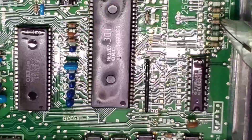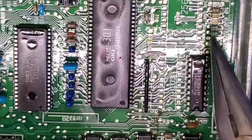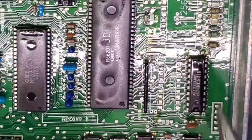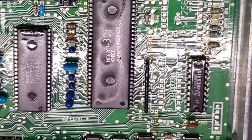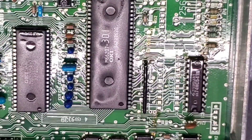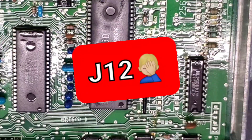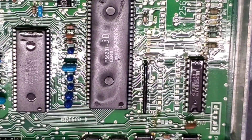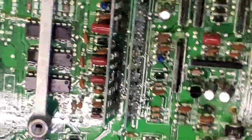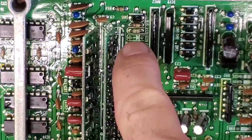We'll remove the RP-17 and RP-18. Most people will tell you to just put a piece of wire between the two connecting points on the RP-18, but I like to use a zero impedance resistor. You can buy them brand new, or you can take them off of the J-17 portion of the board, which does absolutely nothing to the programming — and it is right there.